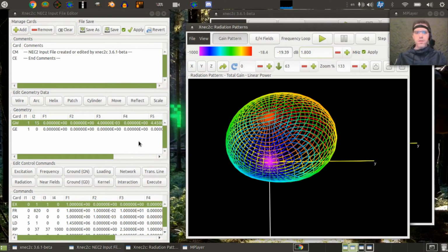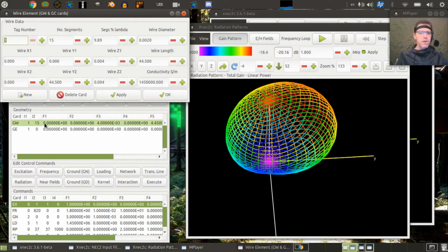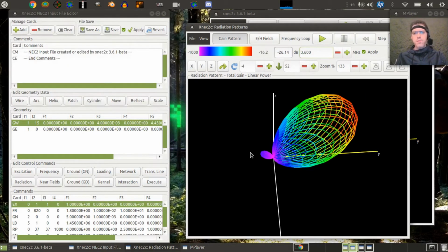So in that setting, if you want to have a very long antenna or a very short antenna, and use a large span of frequencies, then you would have to use either 2 antennas, or you can have this antenna wire that we have here, the full length, and you can make links in it. So for instance, let's take this one. This is an antenna on the ground, of 4 millimeters wire. So we go back to the 80 meter band again.